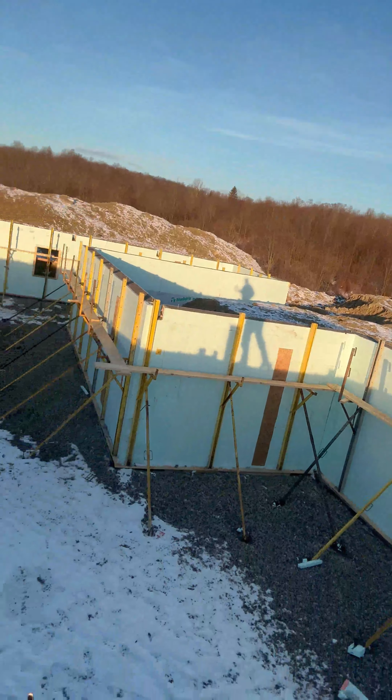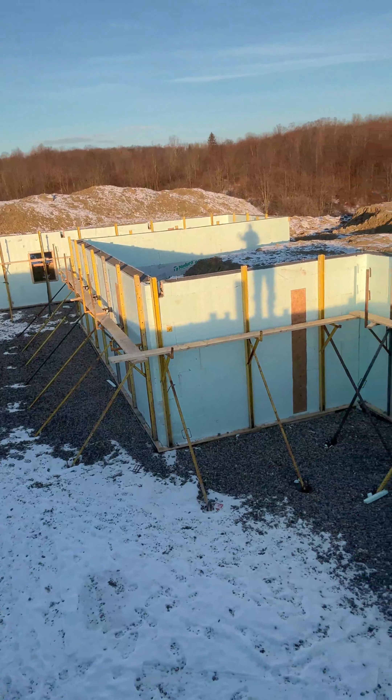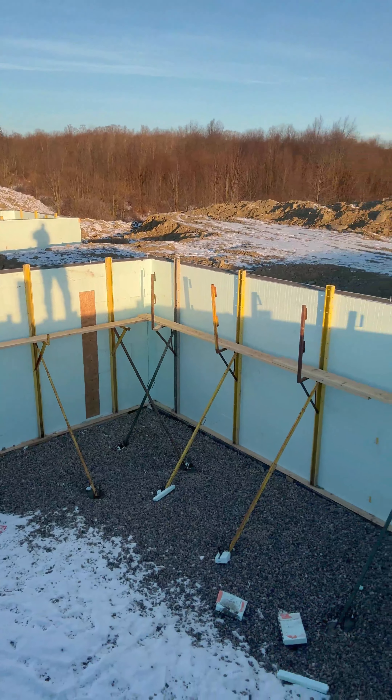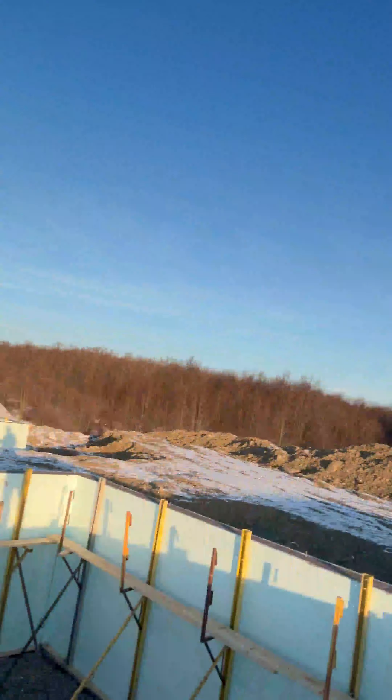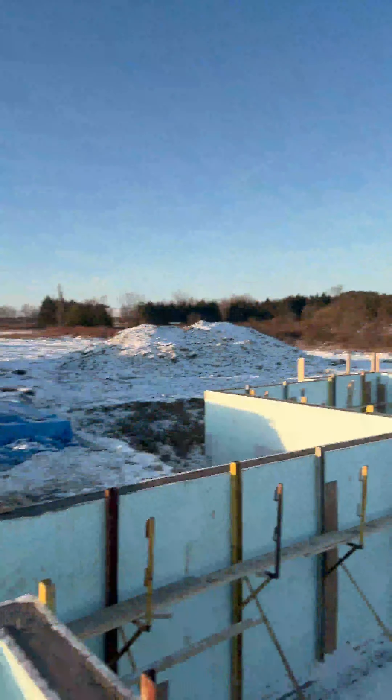Today's going to be the reverse of everything that we did. We're going to do a little bit of time-lapse photography to show the disassembly of the system bracing — that being all of the wall turnbuckles, the scaffolding boards, string lines, and temporary plywood we put around the inside. This will be an empty space when we're done. We've got three trailers for bracing and lumber — there are a lot of bits and pieces that go into this, and it is definitely very labor intensive.